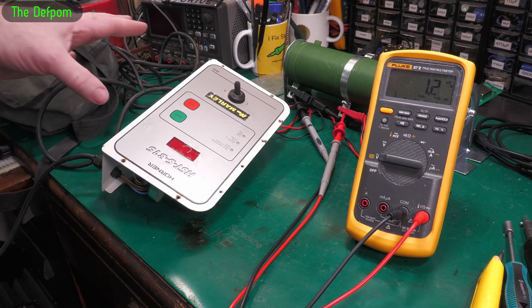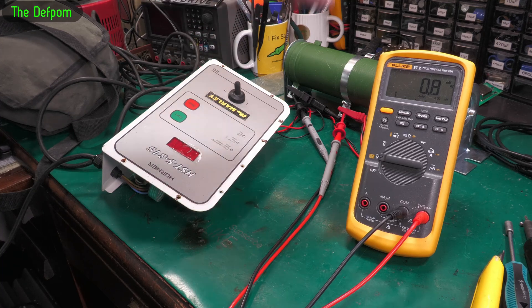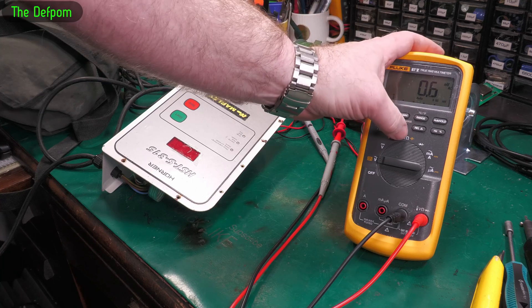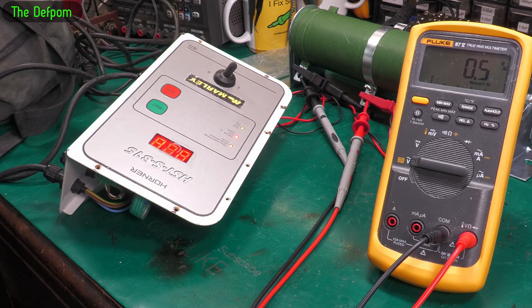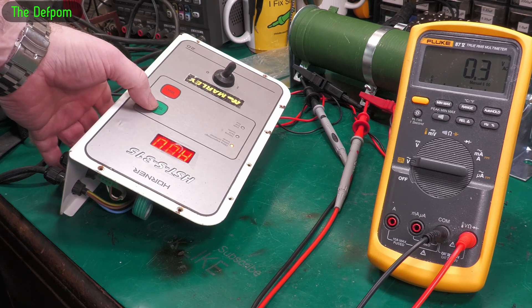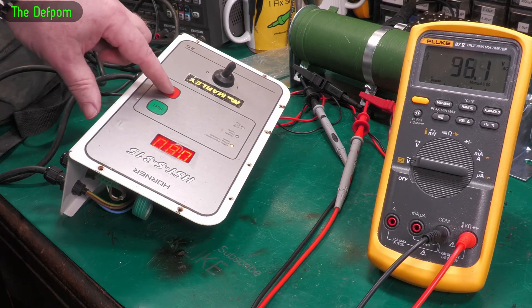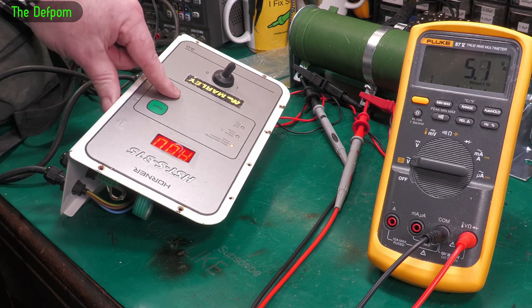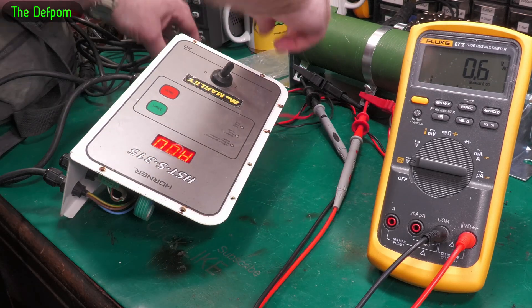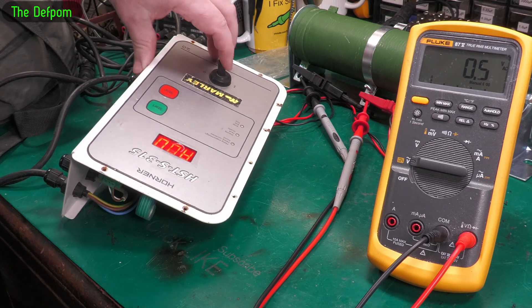Now I'll test it out and see if it actually works. I've got my test rig set up - a 20 ohm resistor which simulates the fittings this is used on. This is set up for AC volts. Let's manual range it so we can get a faster readout. We'll turn this on - it's detected a fitting. Let's push start and see if we get 100 volts like we're supposed to. We do - 100.7 volts. That's working correctly. If I disconnect the fitting, it registers it's disconnected. If I try and weld, that's fine. That one's finished.